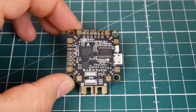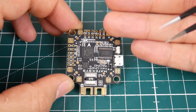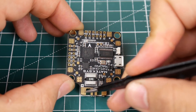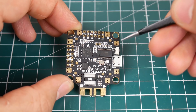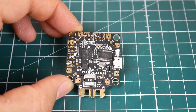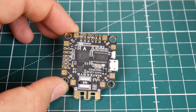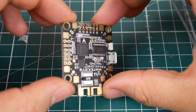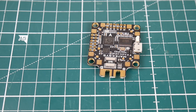There's really no need for noise testing on this board because the VTX power comes straight from the battery rather than through a built-in regulator. Noise performance will come down to your ESCs. If it had a 9V regulator, we'd run a noise test to check how cleanly it powers the VTX, but in this case that's not necessary.